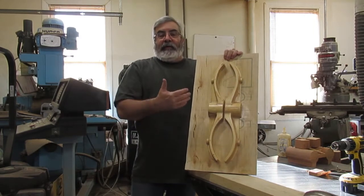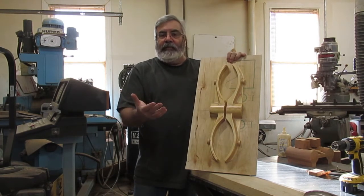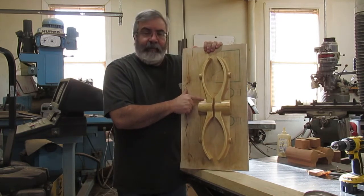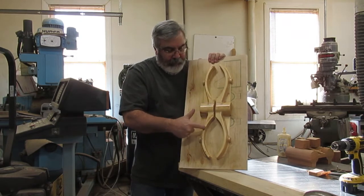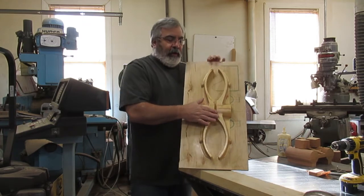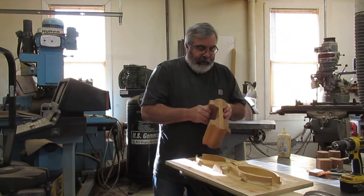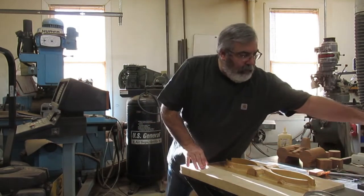You have to determine how you want to build these things. This one I just kind of - I didn't throw it together, but I didn't build this one as rugged as we usually would, because all I got to do is get a plastic mold off and we're done. So I just made it out of pine. My mahogany is getting a little bit low, so that'll work really good. I put some plastic fillets in there as usual - that'll help hold everything together. Basically I just cut this shape out here, and then I added these ribs in here. I just kind of added everything like we would have done if we were going to do one wood one - just split that rib in half for the parting line. But since we're just going to make a mold off of this, we're just going to do it down and dirty, simple.